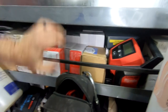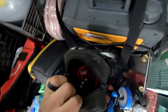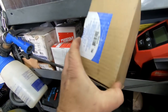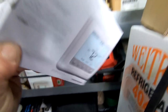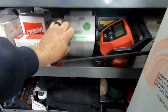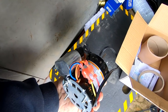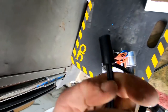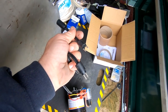It's a pretty common motor. There's my little bag I use for when I don't need a whole lot of anything special - just basics, meter, pliers, and stuff. Pretty popular little motor for small reach-ins. Here we go, the 9656. This one works out pretty good - it's reversible. This does have the two plugs on it, the really wide one and the thinner one. This one takes the wider, so I usually tape these two together so they don't come apart.